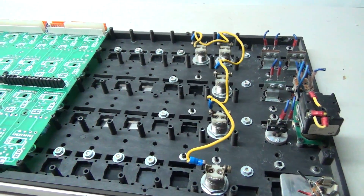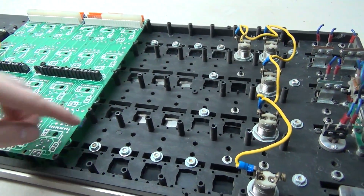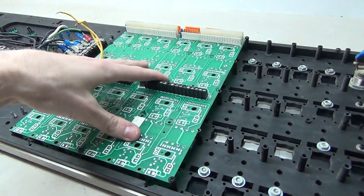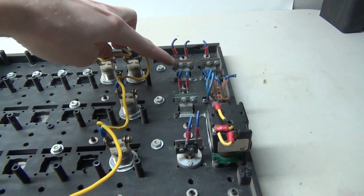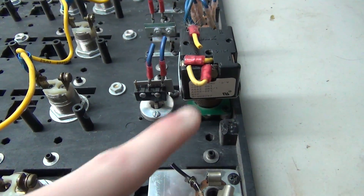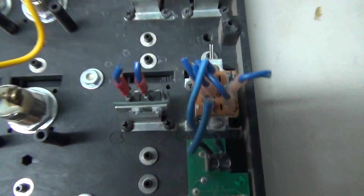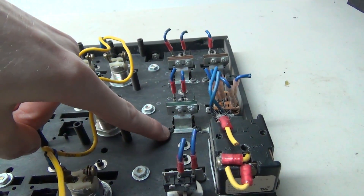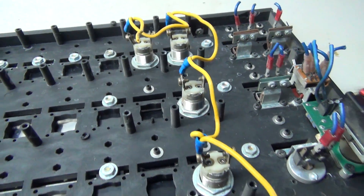Starting down here at the bottom, the first thing you might notice are all of these cutouts. Like a lot of elevator panels, this was a modular design, so you could pick and choose what sections you wanted to use and have modular parts that would go into each one. Up here we have the circuit boards for all the floor buttons, down here are some key switches, here are standalone buttons with no lights, and the fire service key switch as well. Here is the phone jack, the fire service key switch, and this circuit board is for the red light bar. These are all standalone buttons and you can see how they're mounted — there's just a locking piece to hold the button into the housing, and then the contact gets screwed down onto the side bits.